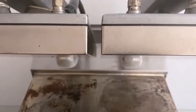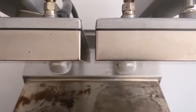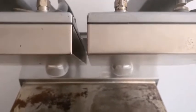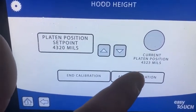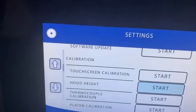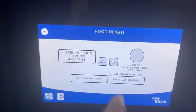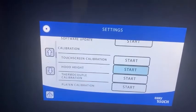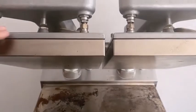For that reason we don't use the arrows — this is why we use the steps and go up and down. Once we're happy with that, and that's probably as close as we're going to get, we come to the controller and apply calibration. Calibration applied, then end calibration. We do the same on the left-hand lane: apply calibration, calibration applied, end calibration. This now means that when both grills are in the up position they're consistent and look correct for the customer.